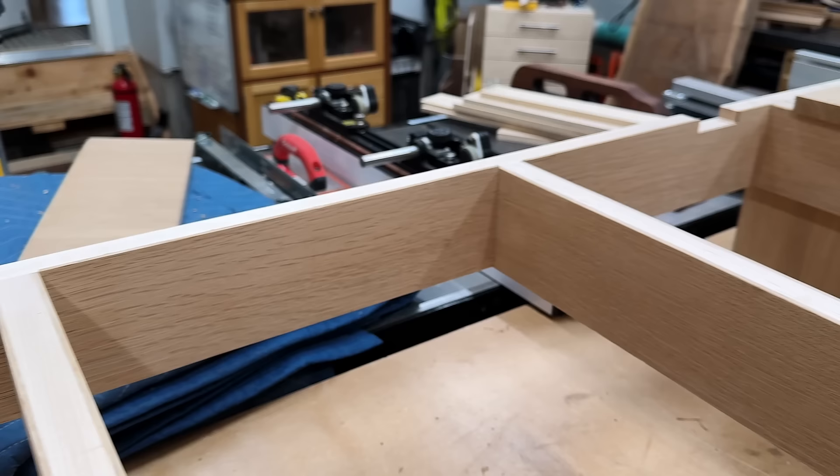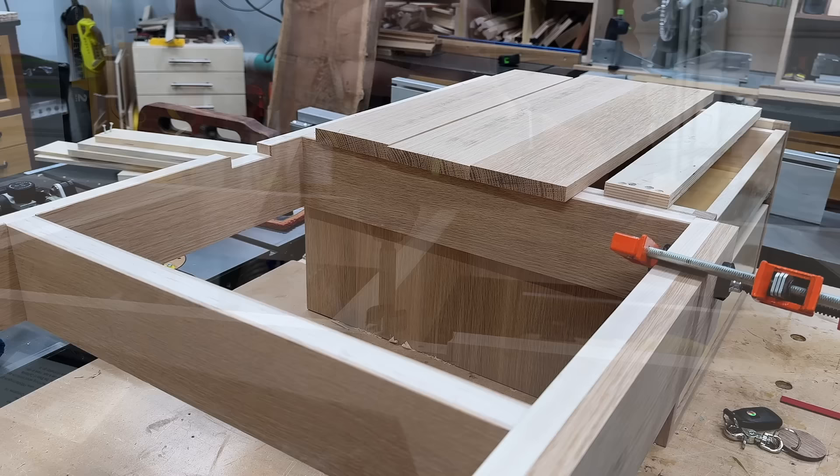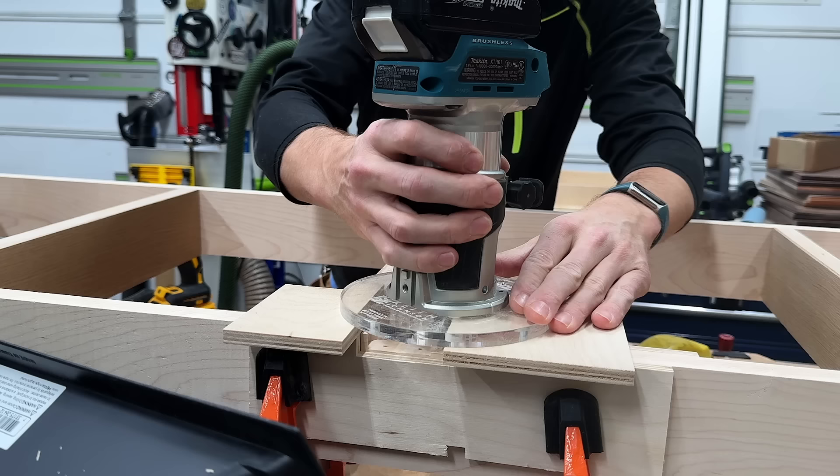At this point, I realized I wanted to make some additional work for myself. I had a bunch of thin resaw strips left over from veneering the plywood box, and I knew if they just sat on my lumber rack I would never use them — they'd cup and twist and be useless. So I decided to take all those strips and veneer the inside of the frame. That way, when you look up, it doesn't look like it was made of maple — it looks like it was made of solid white oak.